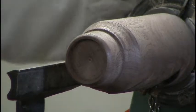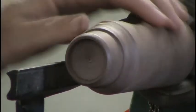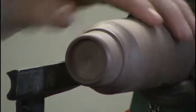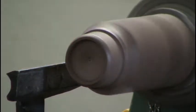They want $65 for a knurling tool, and I'm not going to pay that. So I'll be just content with a nice little lip that's going to sit on the acorn. Then what we'll do is say that's pretty close to the top height, so we'll just part it off.